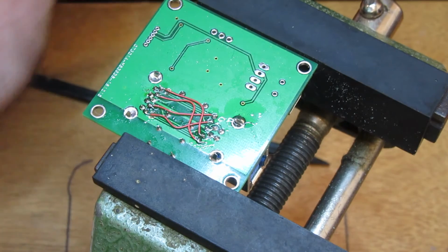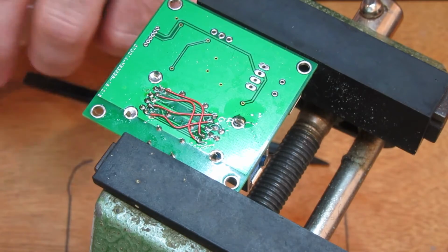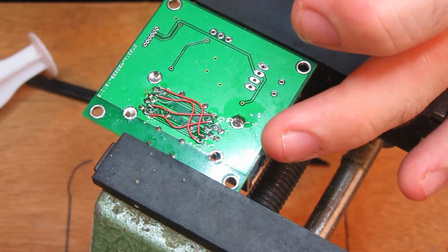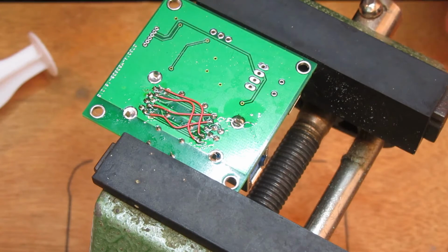USB 3 devices. If you're wondering, even with this botch job, so long as I only pass the USB 2 cable into the B socket side, or bread loaf as I call them, that'll be fine. It'll then just behave as a USB 2 device, and I can still use these perfectly normally. It'd just be nice to sometimes have the USB 3 for the occasional time where the device is actually behaving reasonably and I can get the data off at the higher speed for moments. So I'll stop this and go plug it in and see how we go.